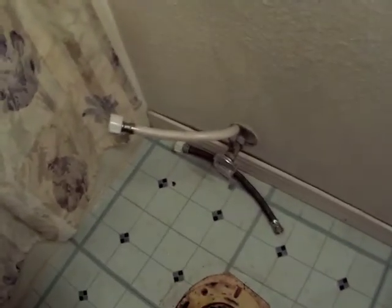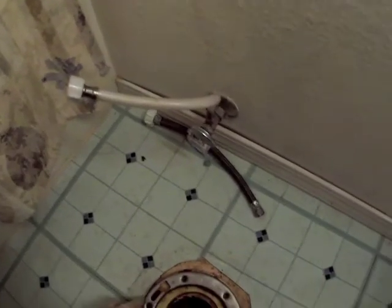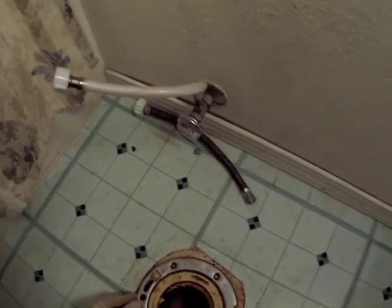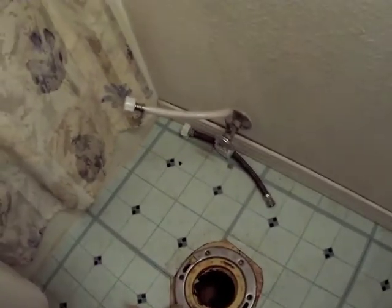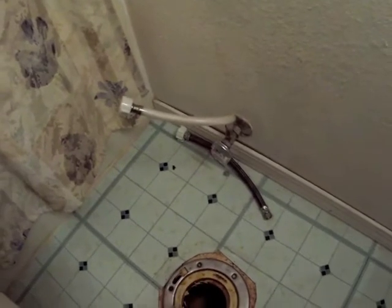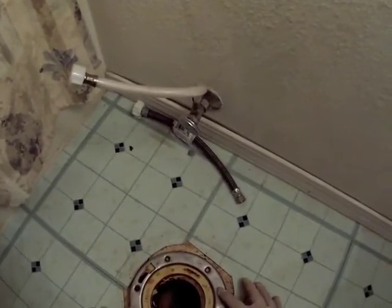I actually prefer to go underneath and cut the pipe and replace it all, but it's a finished basement underneath and they don't want to deal with that. So we'll just screw this on top of this old flange. There's enough room that it will fit under the bowl, and the wax will still seal to the original flange. All that this stainless steel flange does is provide a place for the bolts to mount.